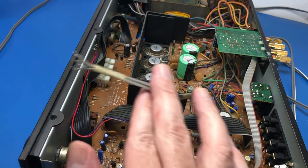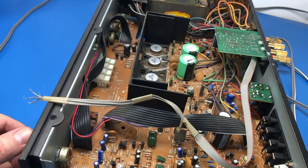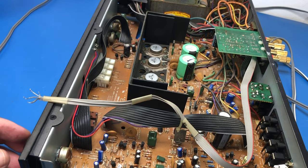So I have taken the bodge out of circuit and reinstated the links. The unit is on, volume full bore, and I hear no hiss at all coming out of those speakers — it was kicking in at about 10 o'clock before. So if I turn on the signal generator, that is much better. That is just bizarre — that bodge, this circuit board, presumably so that someone could plug in a DIN cable, has effectively ruined this amplifier.